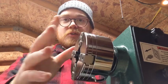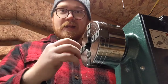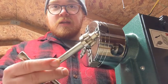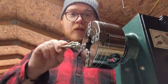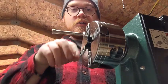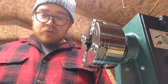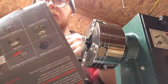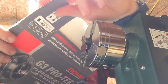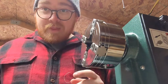Okay, it's nice and solid on there. Because of the direction this spins — it spins towards me — it will actually tighten as the lathe is turned on, so it's not going to come unthreaded and hit me in the face. This is the key — a nice chunky key — and it goes in here. This is what you use to close or open the jaws. It comes with a regular jaw set, and it also comes with pin jaws, which have a very small circle that will really fit a rod when I'm turning stems. But we're not going to put those on today — we are going to put on our new pipe jaws from Vermont Freehand.